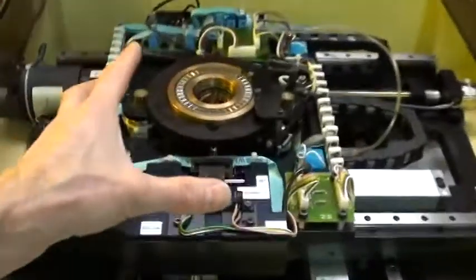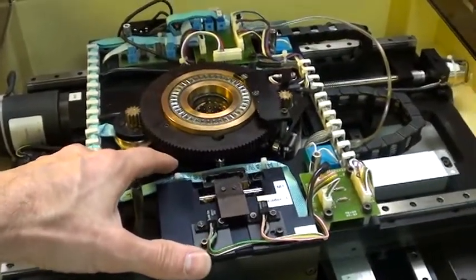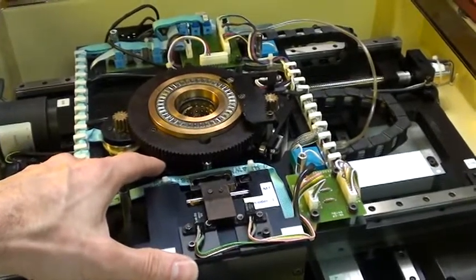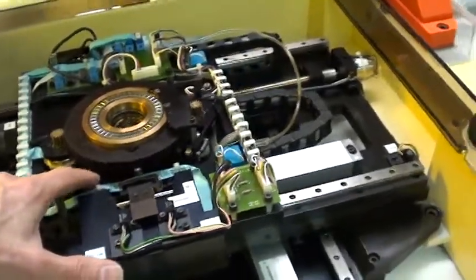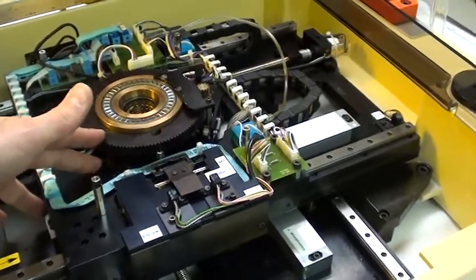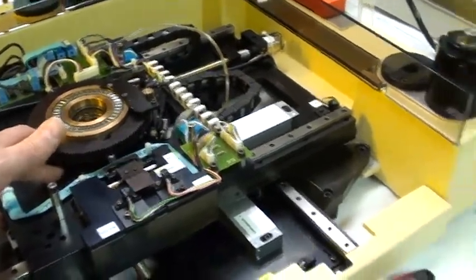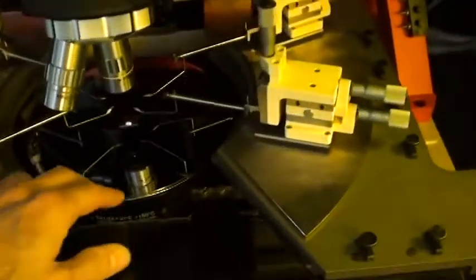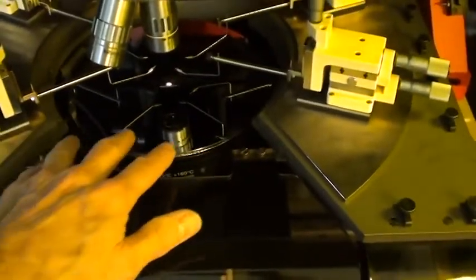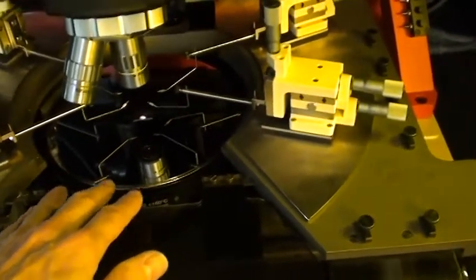And it simply wasn't worth the risk of pulling this whole assembly apart to try and replace the parts that would be needed to get a perfectly flat, perfectly level chuck. And having to use other parts, say from this system, there's no guarantee that the little pad underneath would be in any better condition, so you still might not be able to get perfectly level. The one other thing that we did do was to lube the theta mechanism, lead screw mechanism, so that operates nice and smoothly as well.